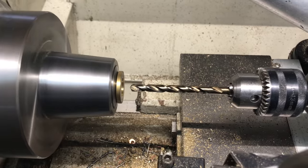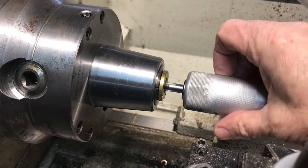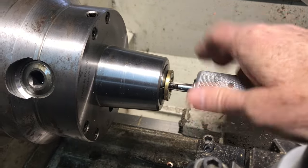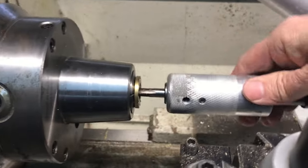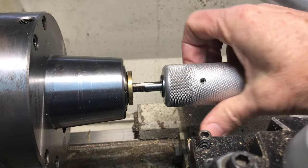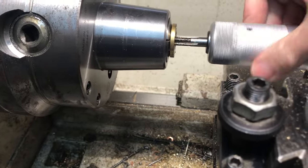The letter K drill is the proper tapping size hole for the 5/16-inch 32 thread. I went ahead and used the intermediate 5/16-inch 32 tap and threaded it by hand, using my set up with the tailstock die holder — I made a tap holder as well.